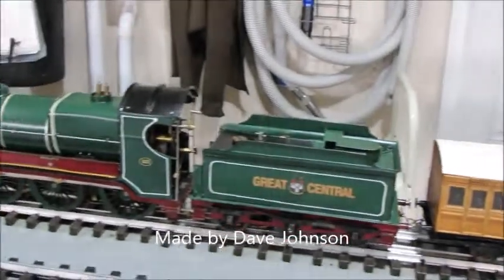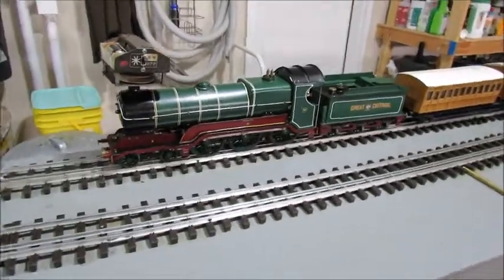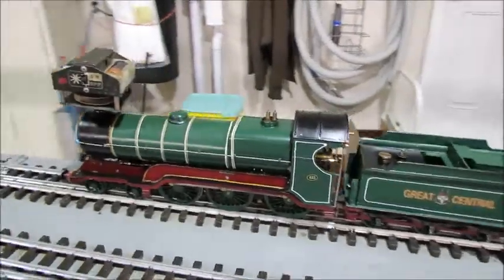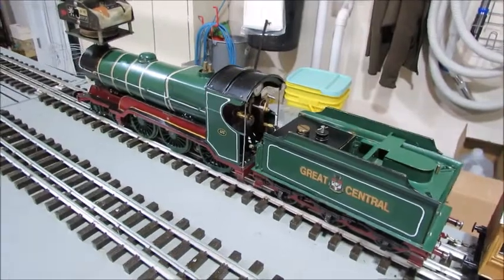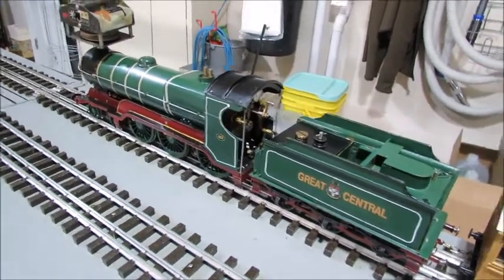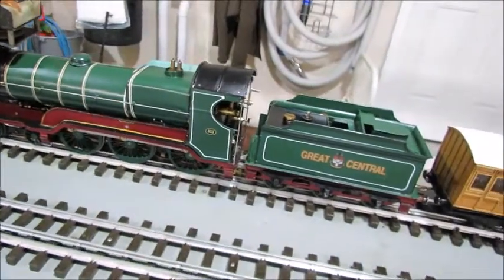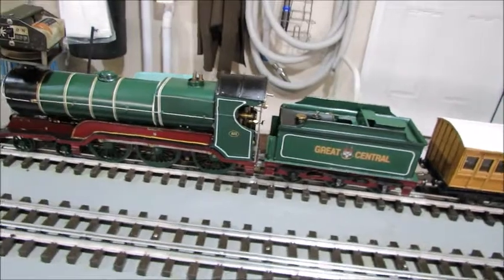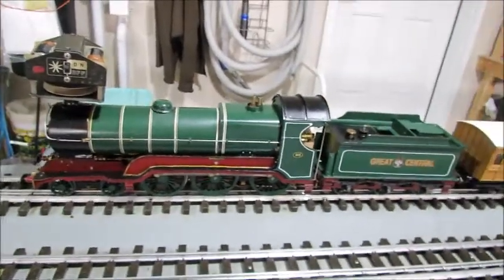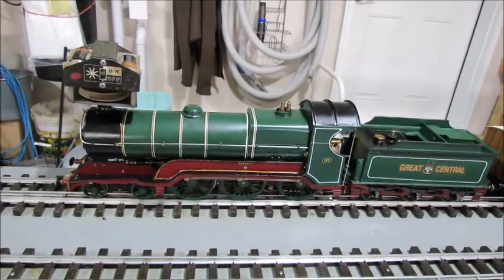There it is, the Sir Sam Fay, steaming up. We had a bit of a problem with the tender pump. It never has worked. I think I'm going to design one with a 3/4 inch ram instead of a 3/8 inch ram. Maybe it'll pump a little more water in there faster. Also, the axle pump needs to be redone. It's also too anemic. There it is, lid off.